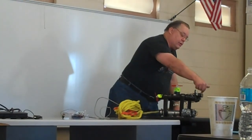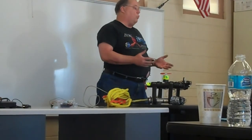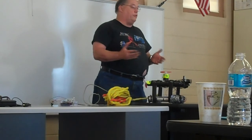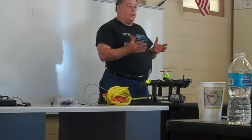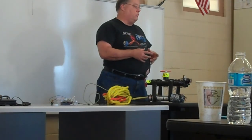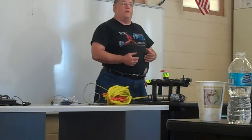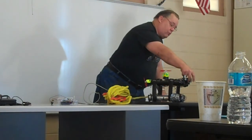Well, that only works in a measuring cup, because the plastic housing on the front of the expensive cameras is not pressure covered. And the front surface of the camera is another very low current device. And even though pool water is nearly non-conductive, it is still somewhat conductive, which means the large currents are unaffected, but small ones are. So you need a pressure container for the front to protect the optics, to keep the surface itself dry. You need the back electronics to be protected, in which case I use the cast acrylic, and together it makes a single watertight, pressure-tight container that is quite small.